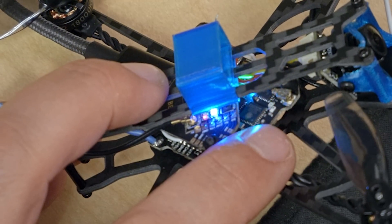Managing this receiver is going to be identical to any other ExpressLRS receiver. For example, we can see this fast flashing orange LED — that means the receiver has gone into Wi-Fi update mode, just like any other EP1 or EP2 receiver. The key thing about UART-based receivers is that you manage them exactly like any other piece of ExpressLRS hardware. The only difference is that instead of soldering the receiver to the TX and RX pads on the flight controller yourself, the manufacturer has pre-soldered those wires and built it into the circuit board. From a software and firmware perspective, it is exactly like a discrete freestanding receiver.